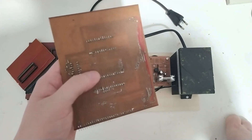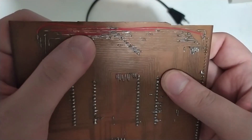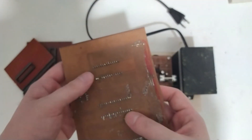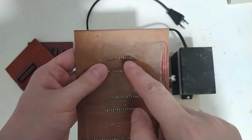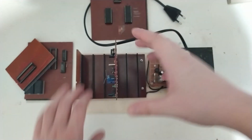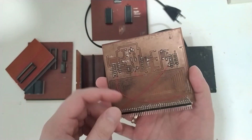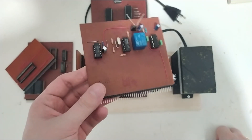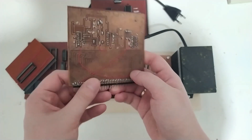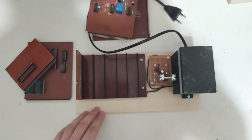Also, doing this all on a single layer on this sort of old PCB material, I had to fix a lot of broken tracks and the etching process really doesn't work all that well with that. Doing it in a single layer also makes it necessary to have the traces be relatively long, which probably causes some issues. Also, this clock generation card — half the circuitry on here isn't working properly and this would need a complete redesign anyway. And this has a breakout for the complete bus which is really not needed.